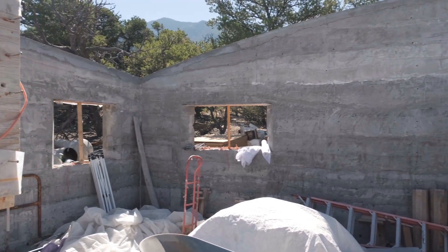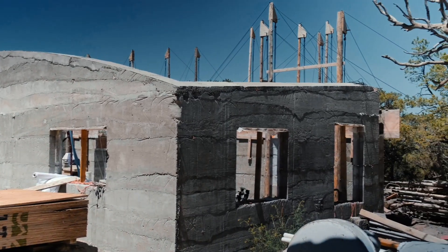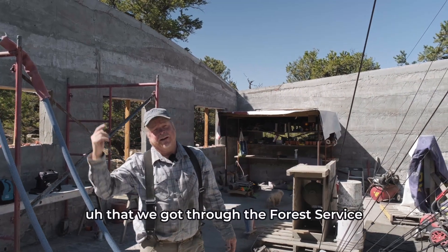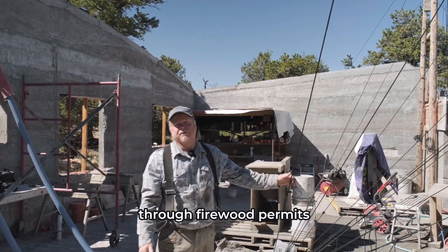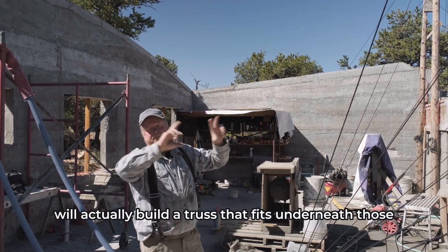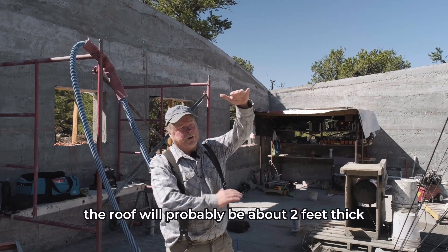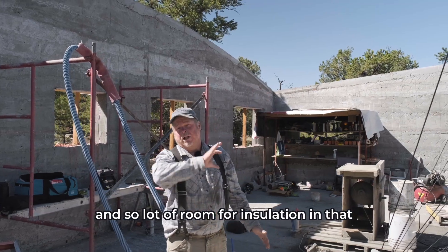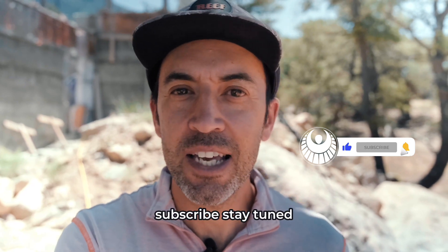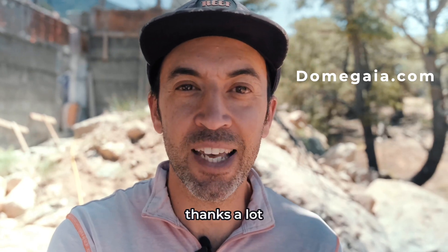As you can see by looking at the back wall, there's a curve and an angle that lays out a curved roof — it curves this way but also angles up. For the roof construction we've got peeled poles obtained through forest service firewood permits, and underneath those poles we'll build a truss that spans the space. The roof will probably be about two feet thick, leaving a lot of room for insulation. I hope you enjoyed the video — subscribe, join our mailing list, and let us know if you have any questions in the comments below.